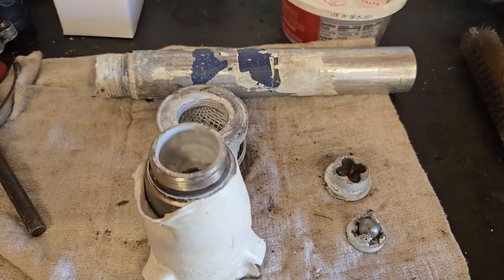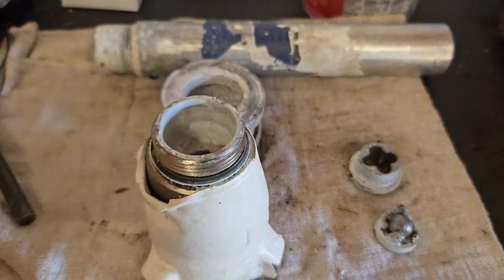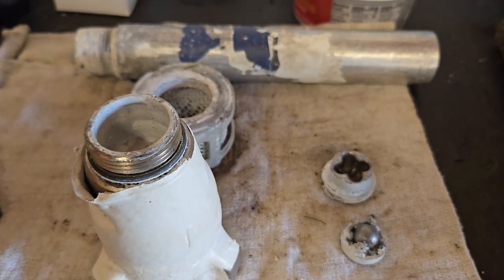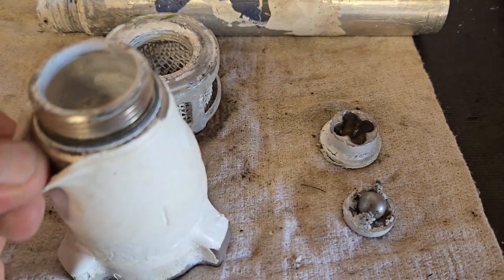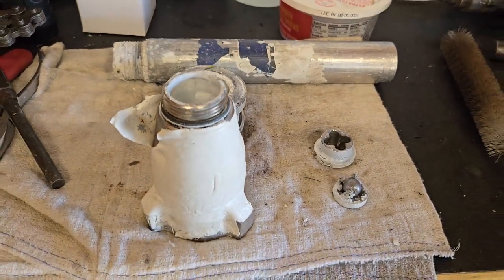You guys have got to flush this thing. You have to flush the pumps. You have to have clear water coming out, or your lines and your pump and your nozzle and everything else will clog up and you will destroy a $10,000, $20,000, $30,000 machine. I cannot stress this enough — and I'm not even a paint expert on this stuff. But it should not come in the shop this way. You guys should really take time and clean it and flush it out real good.